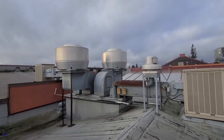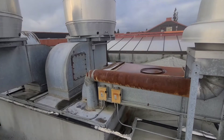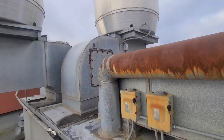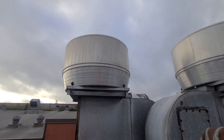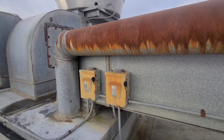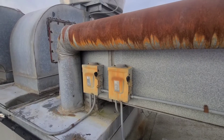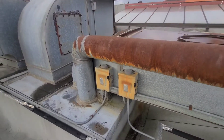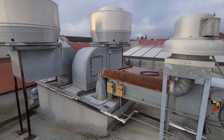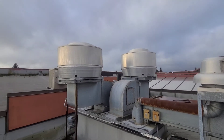I think it was the day after they were out here that the thing stopped working. So obviously the first thing I'm going to check is the power at the disconnects, making sure I have power coming up to it. If my power looks good, then I'll get up here and pull this apart and see what I'm seeing. The good news is both these disconnects are left in the on position — a lot of times when you have someone come out and then a service call right after, it's usually something silly like the disconnect being left off.